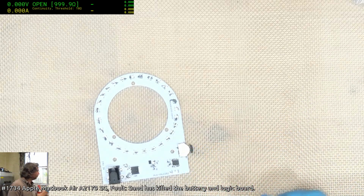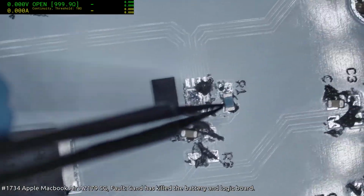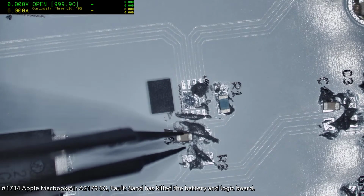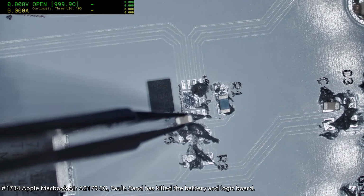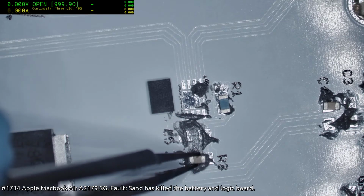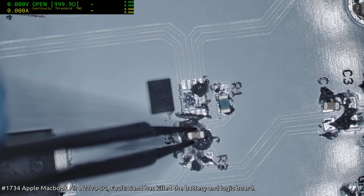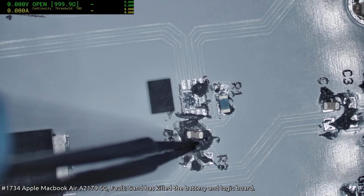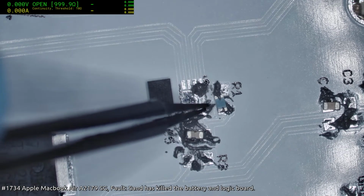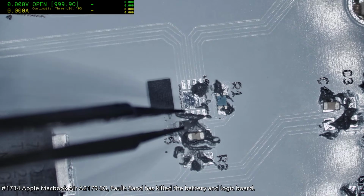Okay, now we're going to have to bring in the microscope so I can align these. They were 603s. These are 603s. No, this is where I got caught out last time, but then I made a change. That's way too much paste. Yeah, that's just going to make a big fat blob. Anyway. Remember last time I had the orientations wrong, like by 90 degrees for these two parts here, but I fixed that. At least I think I have.